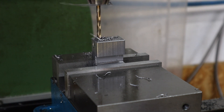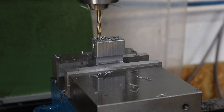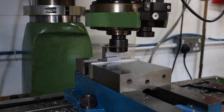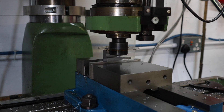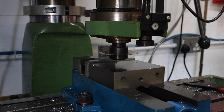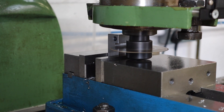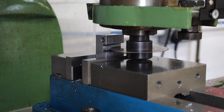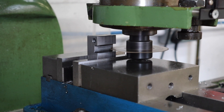Because we need to split this part and the holes aren't the same size on the front and rear, I'm going to go in now with a 4.2 millimeter drill before we part this off and drill these out further. Zeroing out my slitting saw on the top, I can then set the distance down and begin the slitting saw operation.